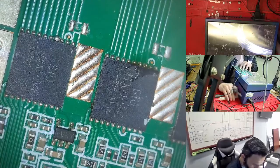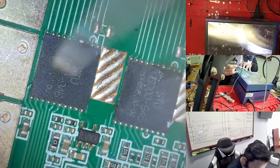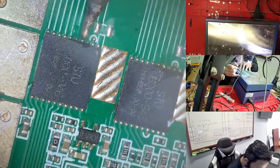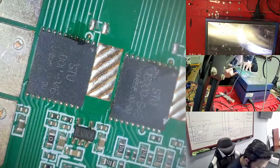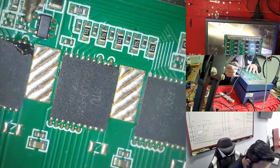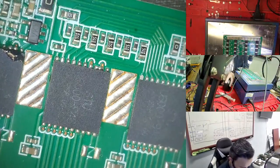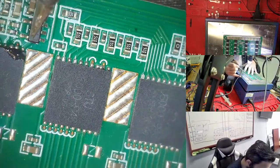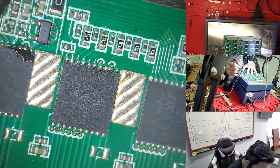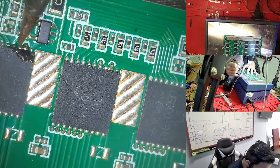And also here too, but no flux, so we need to add some amount of flux because it's not working. So here is not bad, but these are bigger, so it's a lot. After, maybe it gets in the machine and makes more, so that's why we need to take out this one too. Because if you see the size of all the pins is the same, just these two, this one is low, so a little bit more.